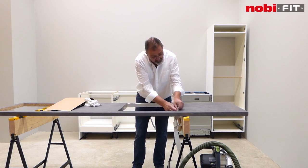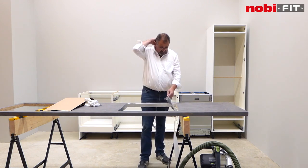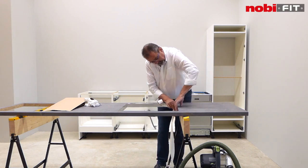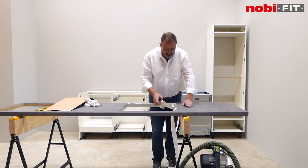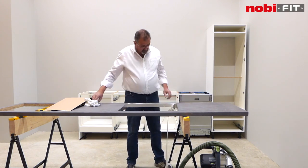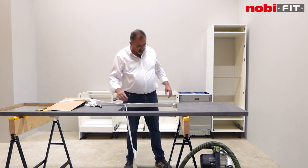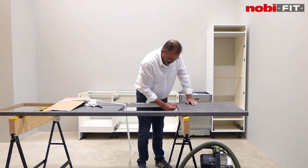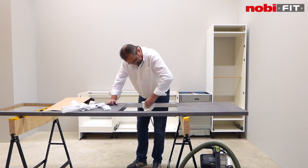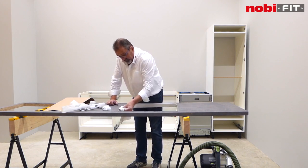And also around hot plates — standard hot plate, induction, gas, or something else — every time we protect the open cut with a silver tape. The silver tape will be delivered with each kitchen, 9 metres. 9 metres is enough for the whole kitchen, and it will be delivered every time when you order a kitchen with a worktop. You get it automatically.